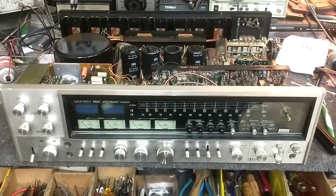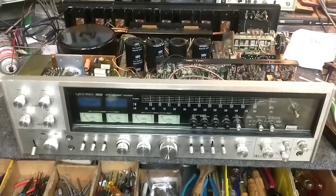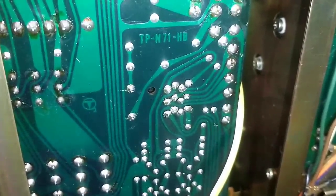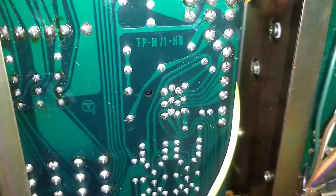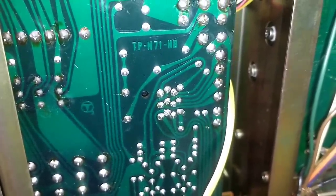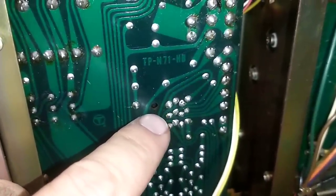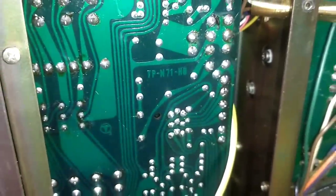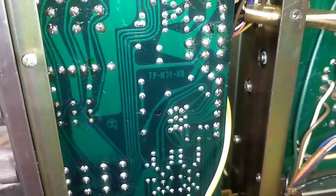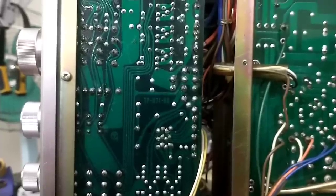So let's get the relay out and I'll show you what's necessary to clean it up. The relay underside is right there, so we just have to unsolder those 14 connections. You've got two for your coil, and then four rows of three, making 12 connections for the bridged versus non-bridged. So a little bit of soldering there, but nothing too fancy.